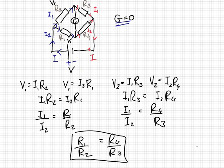Look at me. You have a box of resistors. And if you have one resistor you don't know, let's say it's R4, but you do know all of these, then you can know what R4 is. And this is what people used to do to find the resistance in a resistor. They take their resistor and put it at R4. Then they have a big box of resistors and they put in different values, and they keep putting in different values until the galvanometer is zero. And then when it's zero,